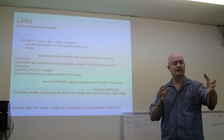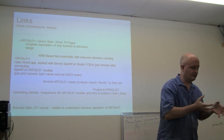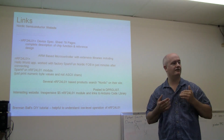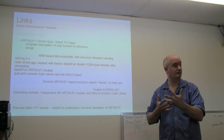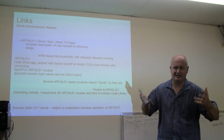In other words, if we embed part of our address within our data, we end up having to take that over into the microcontroller and look at it and reject it there. Whereas if you did have 6 unique pipes with all unique addresses, the radio would end up rejecting those bad addresses, if that makes sense.